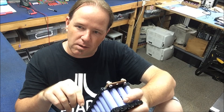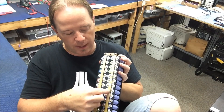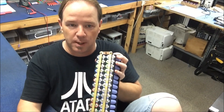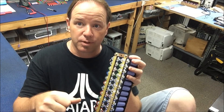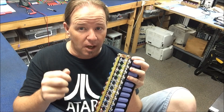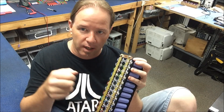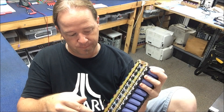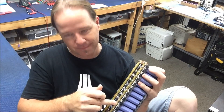I need to do it a little bit deeper, and I need to get that new soldering iron on Monday so I'll get it a lot hotter. Also I found that when I was soldering — I'm pointing to it and you can't see it — when I soldered up, this bus bar was getting hot, so there's an awful lot of heat transfer. So I'm going to take the bus bars off and do them separately. I've got a big bit of steel plate that I can really put some heat into, lay the bus bar on top, heat it up as well, and hopefully I can just drop in some one millimeter solder and it'll just flow into the gap without too much finishing work. I'm four months into this and spending another couple of days on bus bars — too easy, I'm gonna get that done.